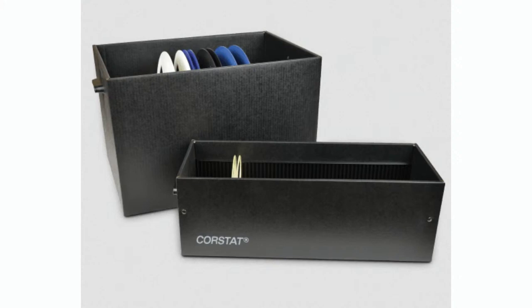I've heard from manufacturers who said, oh, I skipped an ESD step and actually that's what was killing 10% of my boards. It's a super shame if you go to all the effort to do some manufacturing, and then somebody who's a little bit dried out and staticky and wearing wool zaps your hardware. So that's why I recommend packaging all your PCBs in ESD-safe materials. And we do that here at Adafruit, and we have another option from CCI.